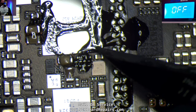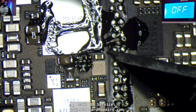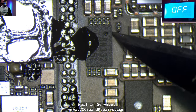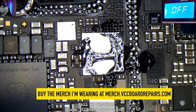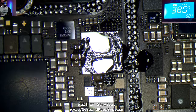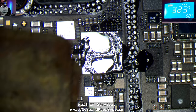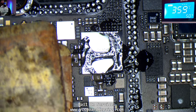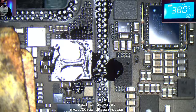Here's the orientation dot, so I'm going to mark the board with a little gentle scratch. The EEPROM goes there. I was mentioning earlier — the name of the chip might be called EEPROM, but actually I think it might be called a ROM. Without the schematics, there's no way to know for sure. If someone can correct me in the comments, let me know.